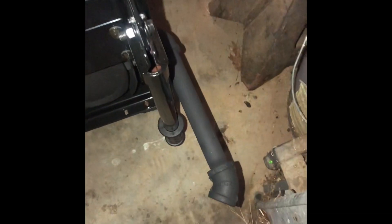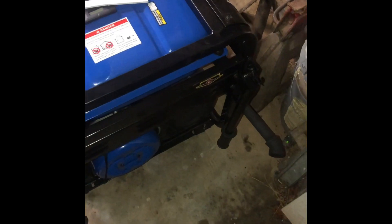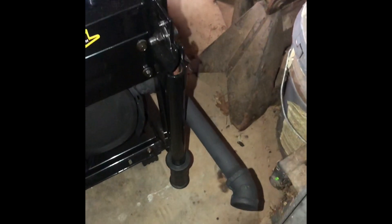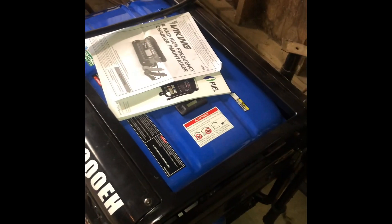I needed the exhaust to come out this side so I welded in some pipe to make it come out the front, because I do leave this unit in my garage all the time and just open the door. It's a detached garage, not that close to the house. The factory exhaust is a back exit so I just 90'd out of there with some 3/4-inch pipe, then an 8-inch nipple and a 45, and it shoots it out. When I run the generator I typically open the door about halfway so the exhaust is shooting out of the garage door and there's plenty of circulation and fresh air.